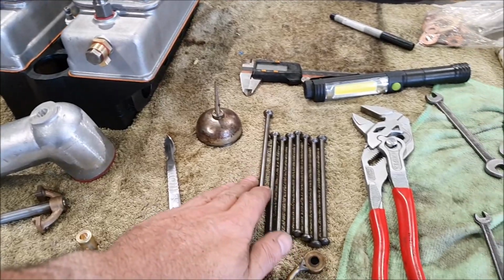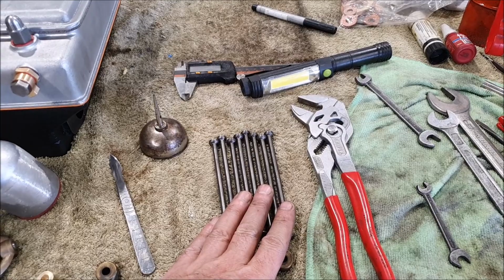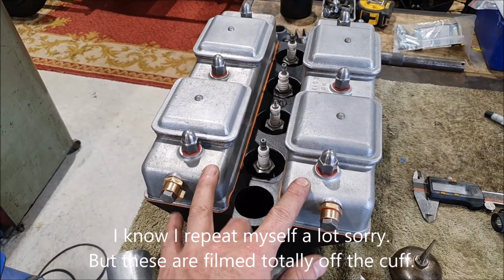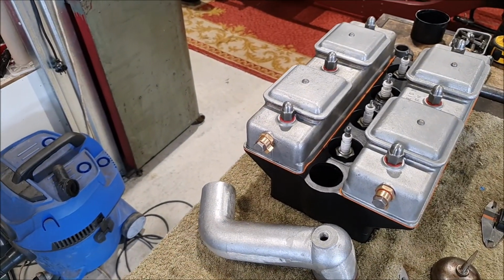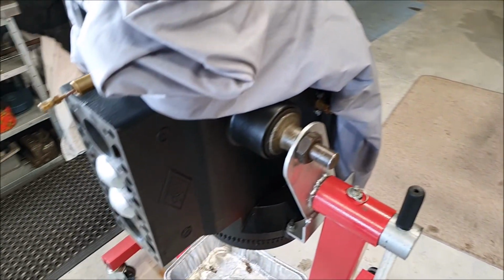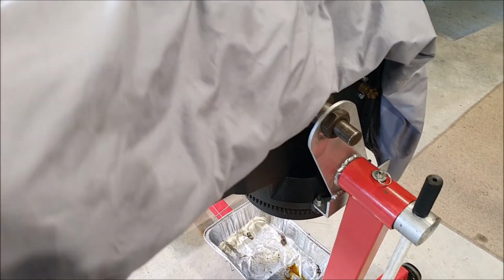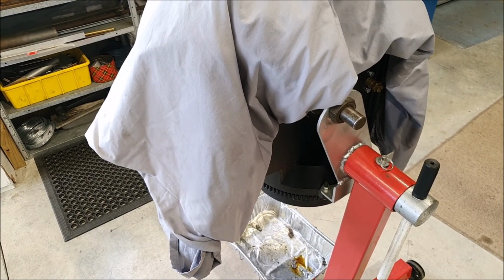I do have new tappets to go with these, mainly because the tappets go inside the engine. All the valve gear, I can always update it later, renew it later on if I need to, because you can get to it. The tappets aren't so easy because you have to take the camshafts and all that kind of stuff out. But I can't do any more on the actual block at the moment. I can't even fit the studs until I've fitted the final piston. So I'm still waiting just for the new piston rings to arrive. I won't forget to gap them this time.